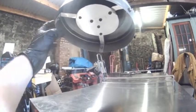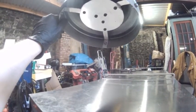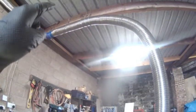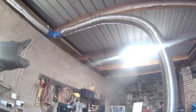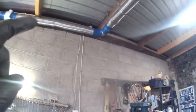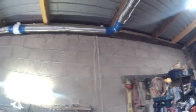I believe it increases the suction — if you didn't have that in there, it would just sort of pull the air in kind of slowly. So we've fitted that. If we have a look further up, it goes up. For fixing it, I've just used 20mm builder strap, and it comes along with a 6 inch metal elbow up there, because the flexible stuff is kind of bad for bending — it will move, but it won't go at the right angle.